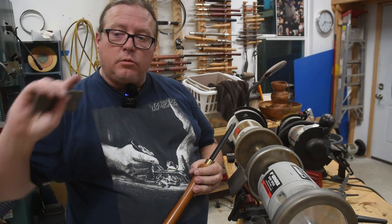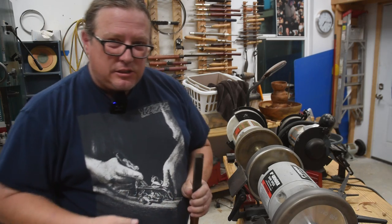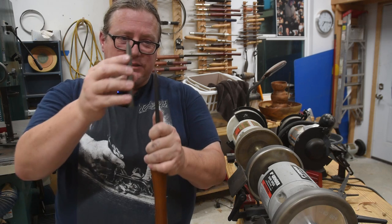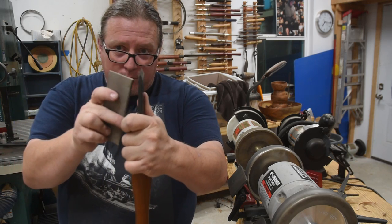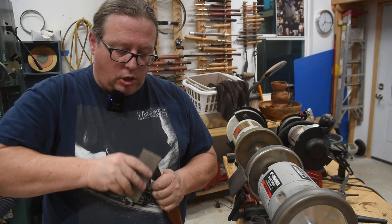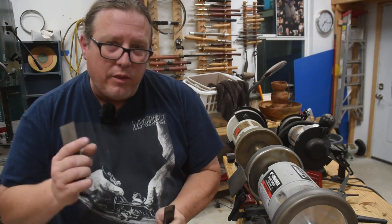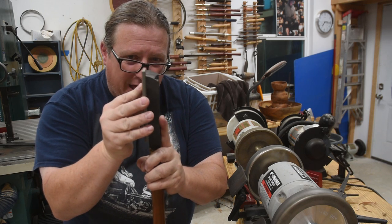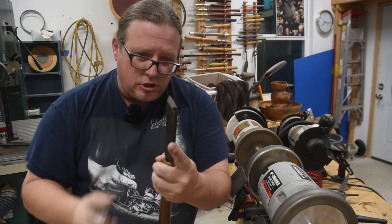This skew straight off the grinder is okay — I know a lot of people who work right off it. But I personally will hone it after it dulls a little. I use this slip stone: I rock it, find the angle, and then rock off the bottom bevel, every now and then touching the top one — that way I keep it straight. This keeps me sharp all day long and I very rarely grind my skews. But even if you don't want to hone, you want to take some kind of abrasive and on that top tip go flat and really sharpen it up, because you'll use that top tip quite a bit in V-cuts and such.